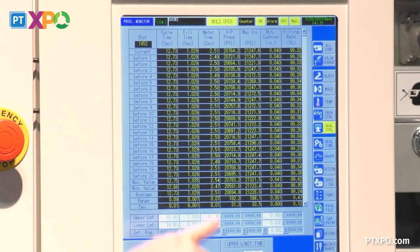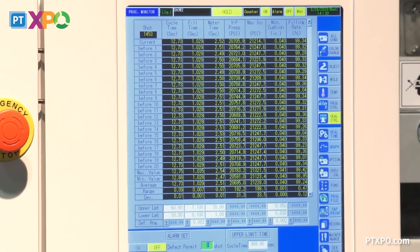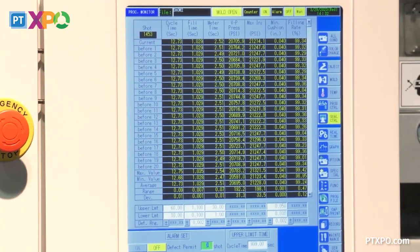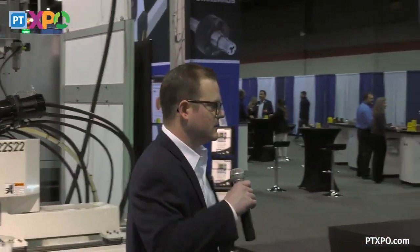So if you look at the last consecutive 40 shots, we've got 0.000, to a fourth decimal place, in terms of cushion variation. And then also extremely stable fill time. But that's the idea with Sodick: you're eliminating some of these sources of variation, because of the injection unit design. So quickly, if you can follow me here.